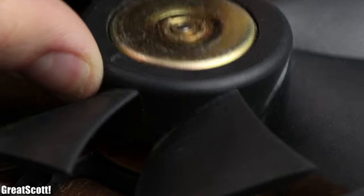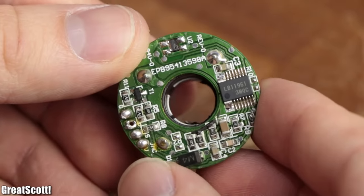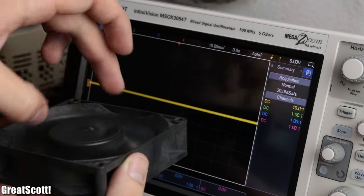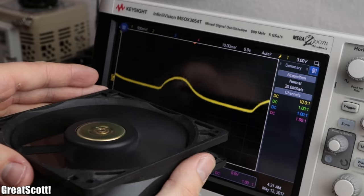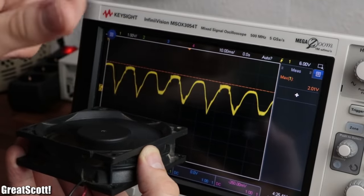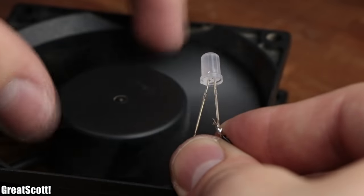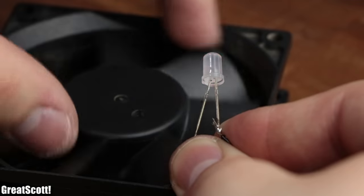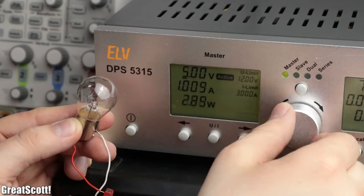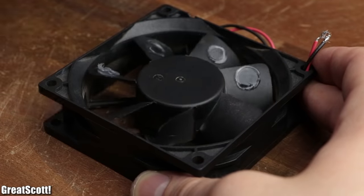The reason is the driver circuit of the fans, which are all slightly different but were never intended to be used as generator circuits. The first fan outputs nothing, the second outputs one half-wave of a sine wave with a peak voltage of 1.5 volts, and the third outputs two rectified halves of a sine wave with a peak voltage of 2 volts. Even using the highest-output fan, the LED's light intensity would only equal a power of around 0.01 watts — definitely not enough to power a 21-watt light bulb. So all in all, the magnet PC fan is bullshit.